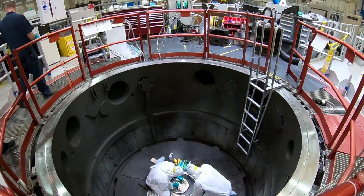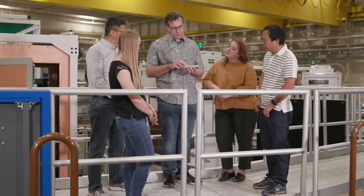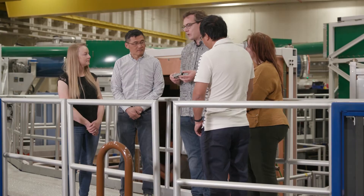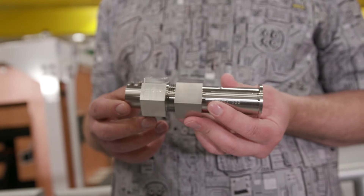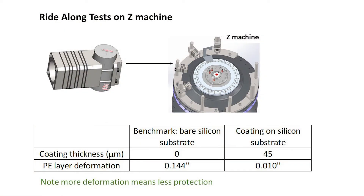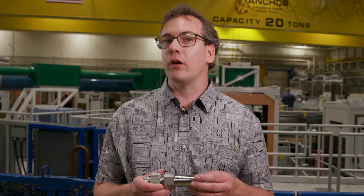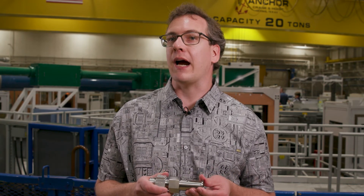Z offers a unique opportunity to test our coatings. On Z ride-along tests, we placed the coating approximately 10 millimeters in front of the witness polyethylene PE layer. We then measure the deformation of the PE layer to evaluate how effective the protection is — note that more deformation means less protection. The deformation of the PE layer behind a bare silicon substrate is 14 times more than behind a 45-micron thick coating. Our ride-along tests demonstrated that the coated samples significantly outperformed their uncoated controls, with no deformation visible behind the coated sample.